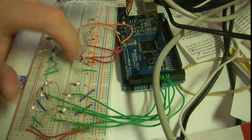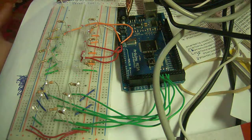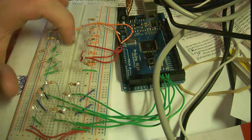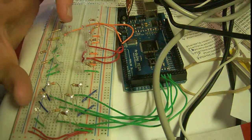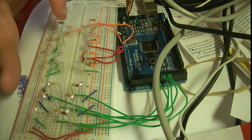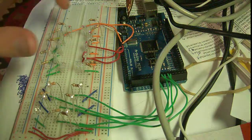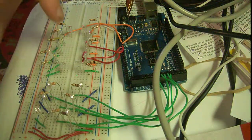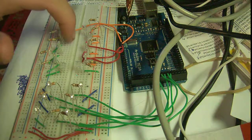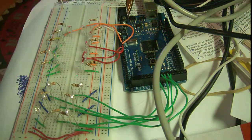As you can see, it creates an imaginary matrix of buttons. I hope I explained this well enough. When you block, say, the bottom left spot, you've blocked this bottom receiver from receiving the signal from this emitter — there's no line of sight. And then you've blocked this emitter from getting to this receiver. So it can tell, if these two aren't getting the signal, then it knows the corresponding coordinates.